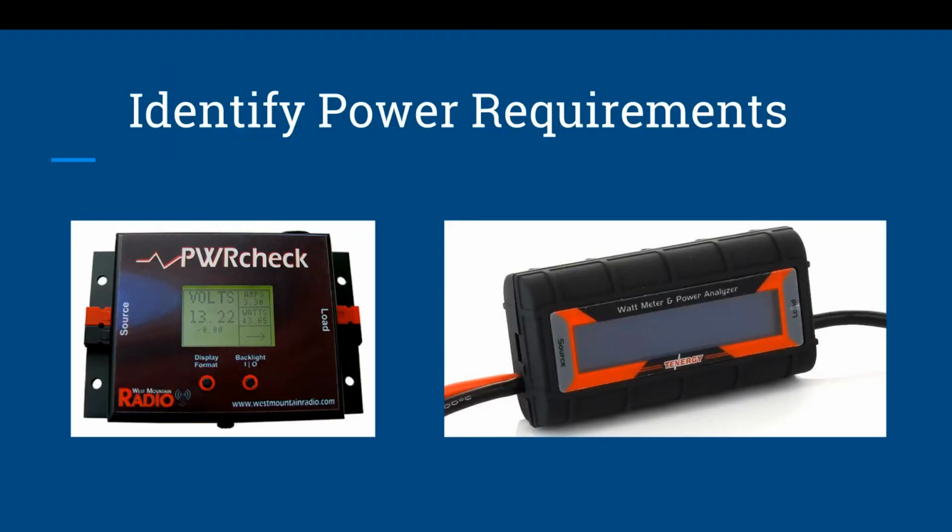So the first thing you need to do is identify your power requirements, because if you do not know how much power you need, then you're never going to be able to meet your goal of regenerating that power. So two things will help you to identify your power requirements. First of all, on the left is from West Mountain Radio. It's the Power Check. This will track your power consumption over time and log it, and then you can plug it into a computer and see it on a graph and see how many amp hours you use, how many watt hours, and when your peak usage was. And you get a lot of information from that.